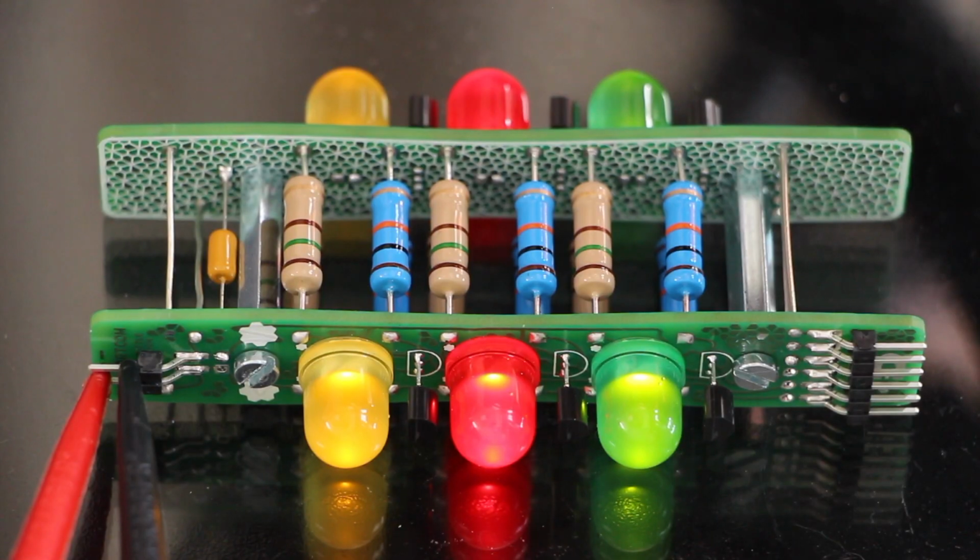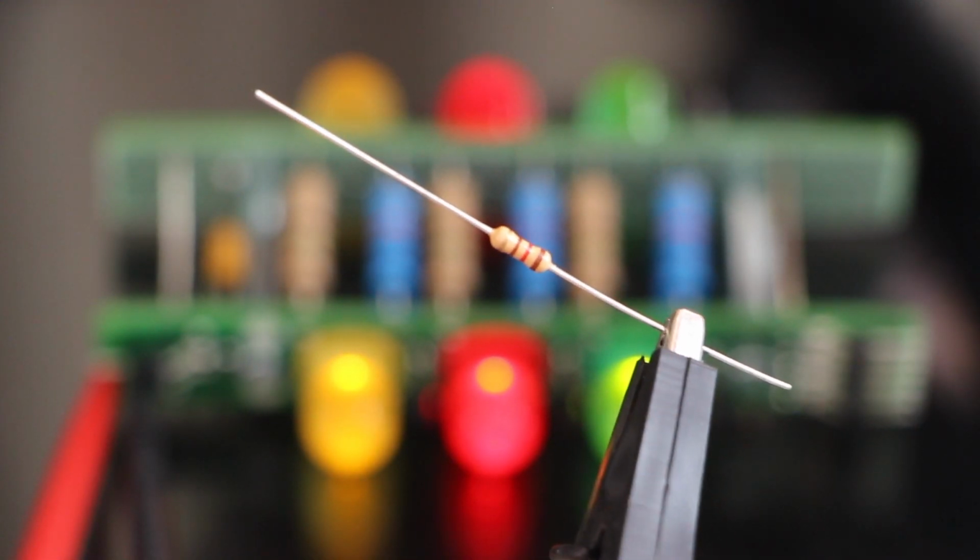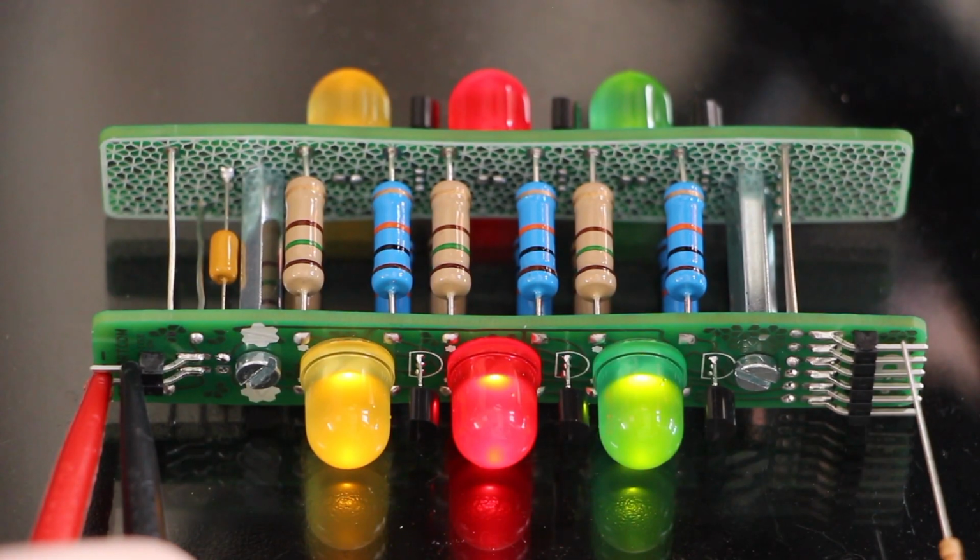Okay, yeah, at 5 volts, each LED is drawing 20 milliamps, so that's probably the highest voltage we should set it to, but that's nice. And I think that's part of why I find these charming. They're definitely not modern LEDs. They're LEDs that take me back to my childhood, which is kind of interesting.